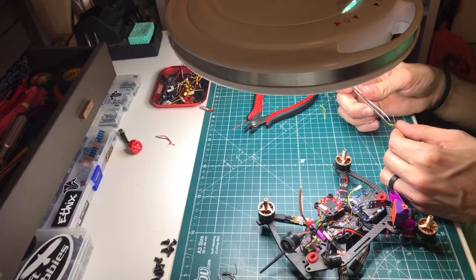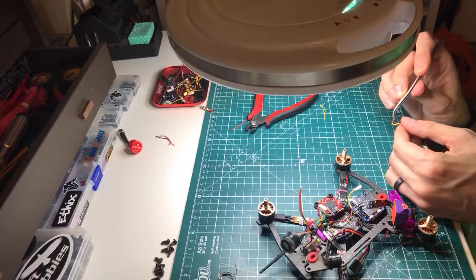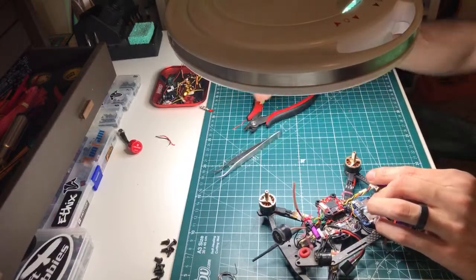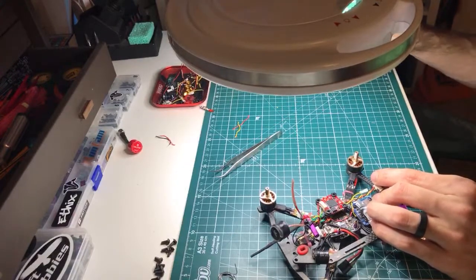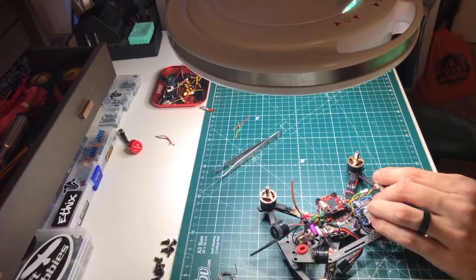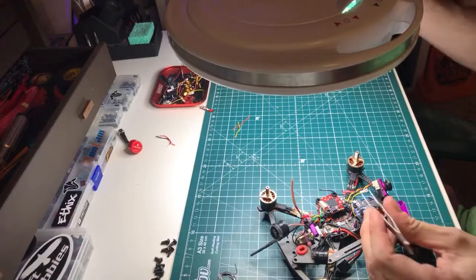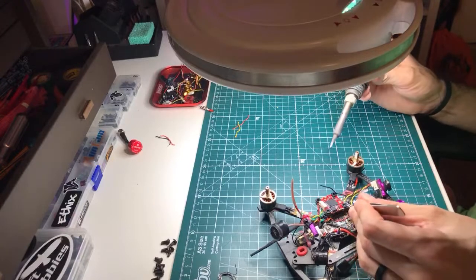Alright, cool. So yeah, the way you solder to this board is from the side. Which I don't hate. Basically think of through holes, but then you bandsaw the board in half, right down the middle of the through holes, so you have half of the through hole left. So you just put the wire as if you were going through the through hole, but just in the side of it, and then you just push in towards the board, and the solder flows, and Bob's your uncle.